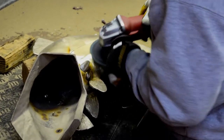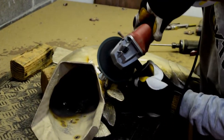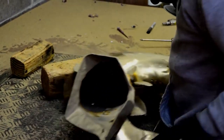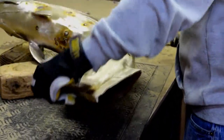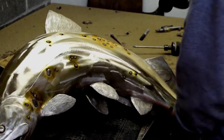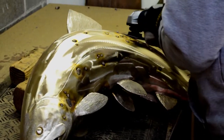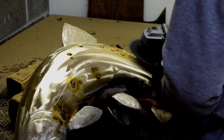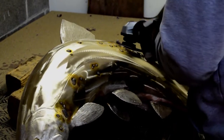The bronze casting is then ground and welded and tooled, very much like the wax before it. Any rough spots or casting flaws are ground smooth and retooled to look like the original surface. Many times the metal tooler will look at the original to make sure their work looks the same.